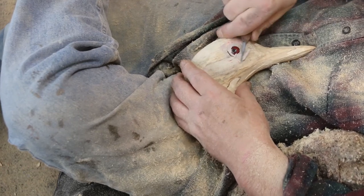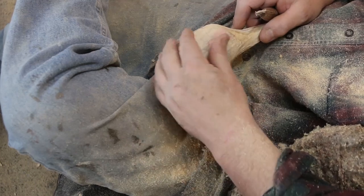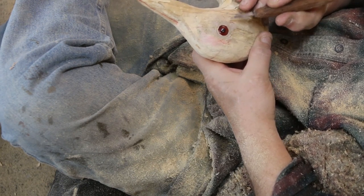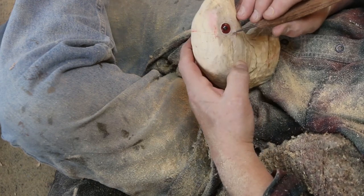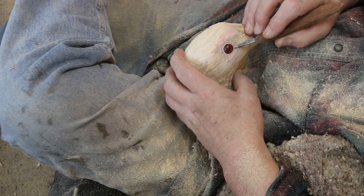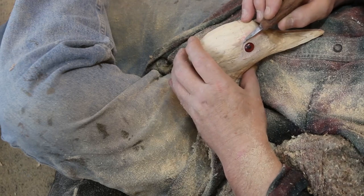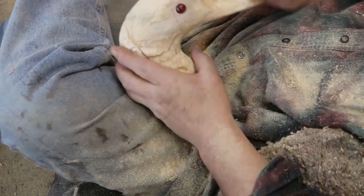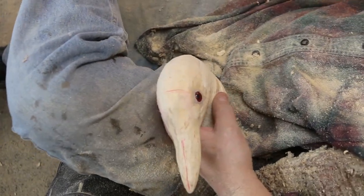I'm not doing it in this video, but I carved the back end of my knives off with kind of a flat spot, and I use that to push the eyes in. Then I go ahead and take off the putty or epoxy with the blade and wipe the blade off — you can see I'm using one of the older knives for that. Now the last thing I do — you see me going around that eye — is build a little bit of an eyelid in there; that saves me having to carve that stuff later on. I go with the flow of where I'm going to draw the feather lines, and I do that while the epoxy is still not set. Later I'll sometimes come back with a little more and put on a finer eyelid. You can do this with the carving on the wood, but you have to be pretty meticulous. Since this is going to be painted, I'm too lazy to do that. But there you have it — there's the eye.